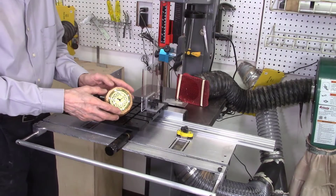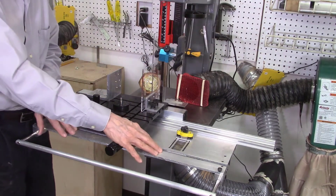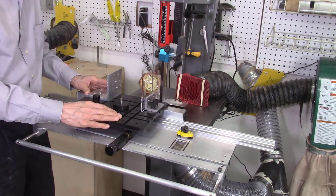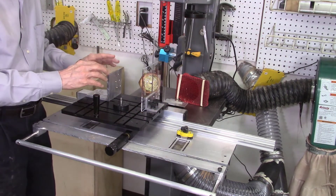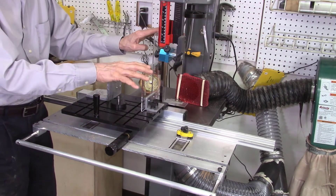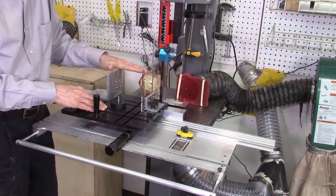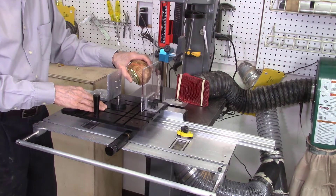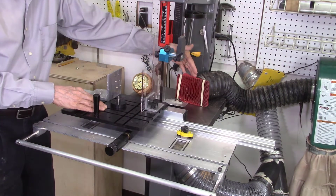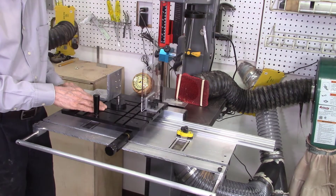In order to produce these faceted wood desk clocks, a number of products are needed. Beginning with the AccuSlice system with a three-foot rail, the AccuSled system, and the AccuFacet system with the L-bracket support plate, the padded disc, and the safety shields, and also the AccuPath laser beam — a great addition that enables you to see exactly where you'll be cutting with your bandsaw. You also might want to consider an additional vacuum system to collect the excess sawdust created on top of the bandsaw.